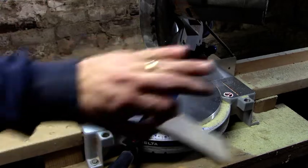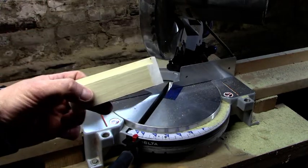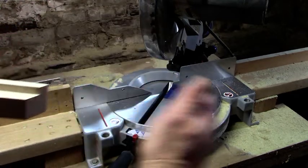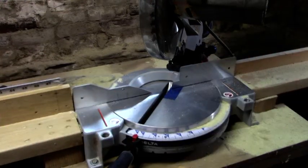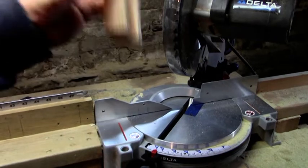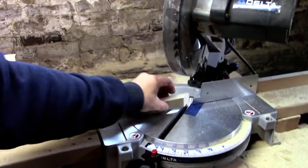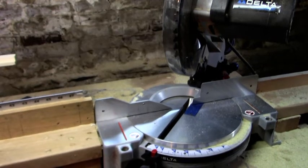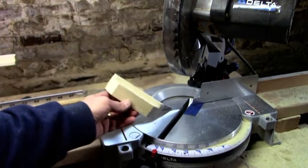You copy this same process for all the sides you need — that's how I cut my molding. For a longer stick with excess left over, once you make your cut, take that longer stick from the support, flip it around, recut the 45, flip it back over, go to the measuring device and repeat whatever size you need, then cut again, flip back over, cut off the excess creating a new 45, and so on.